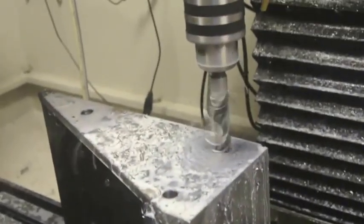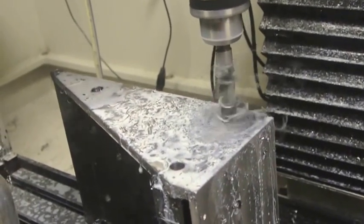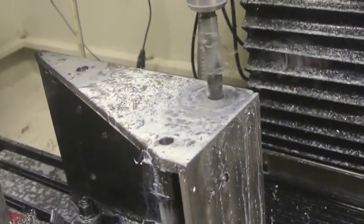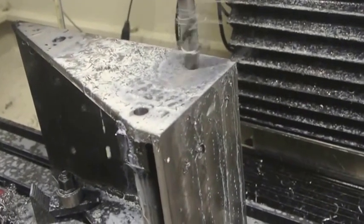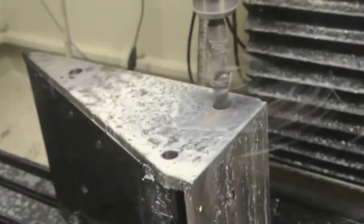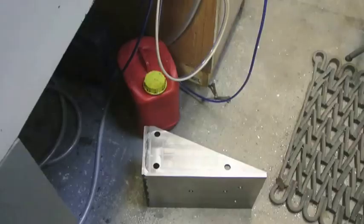Here we are, just finishing the last of the holes in this thing. It seems to have gone OK. There were a few problems initially - it was a half-inch drill which looked a bit blunt, and it kept slipping in the chuck. Once I tightened the chuck and reset everything it was fine. The hole seems to be reasonably centred on these blocks of metal that I welded to the side. This hole here I thought would give trouble, but it didn't on the other side, so hopefully it won't on this one either.